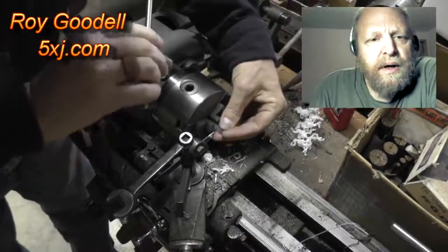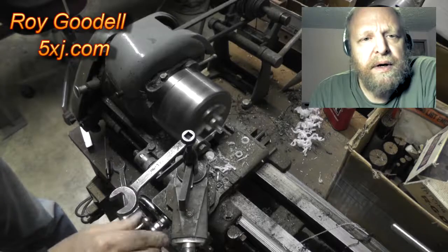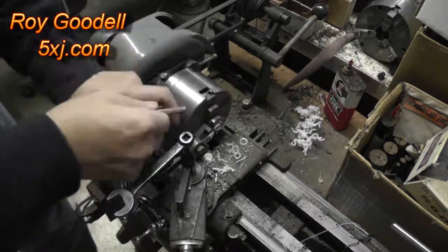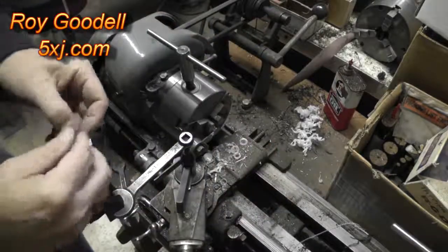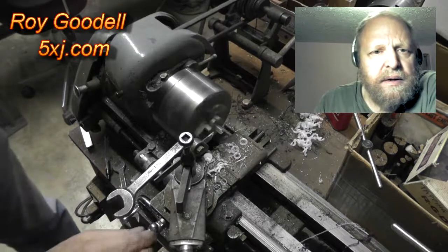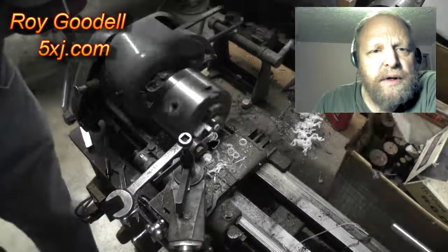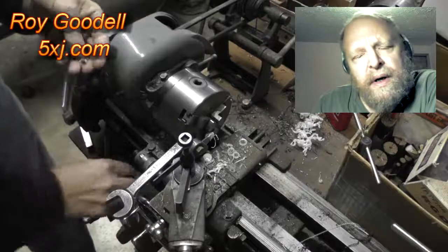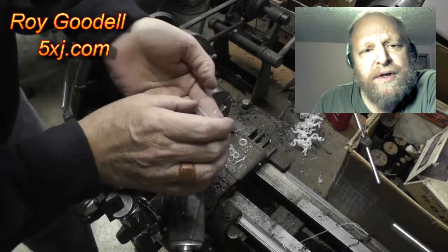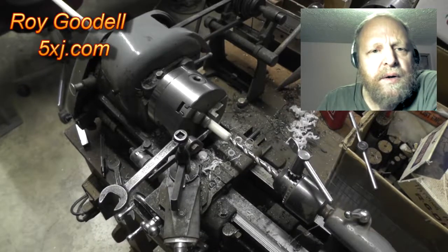Now we're going to remachine the two pen threaded tips and make them a little smaller. Bigger than it needed to be, longer than it needed to be. Cut off the second pen body to a shorter length. We'll have the two pieces, and when you put the two together, that's going to be the minimum length for the new digitizer. If you want to make one a little shorter, you may have to machine these pieces a little shorter, obviously.